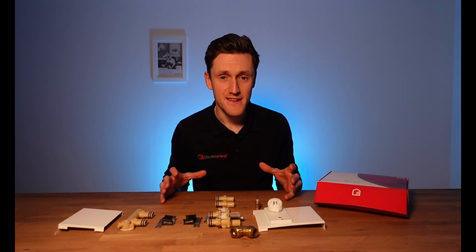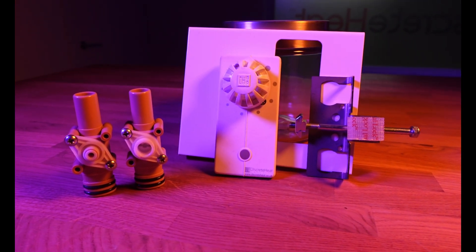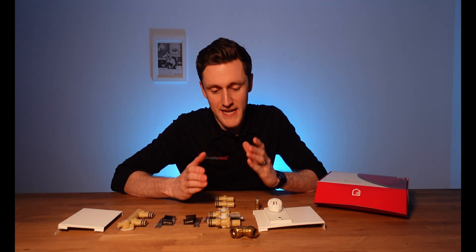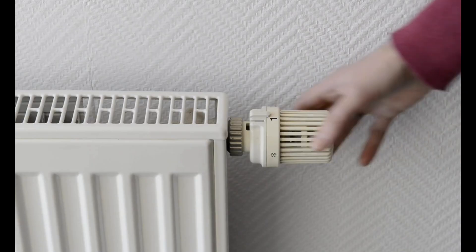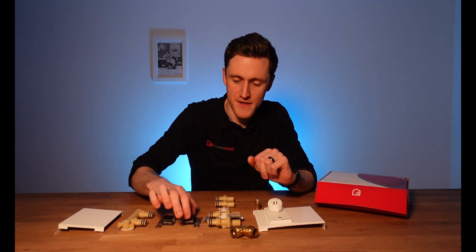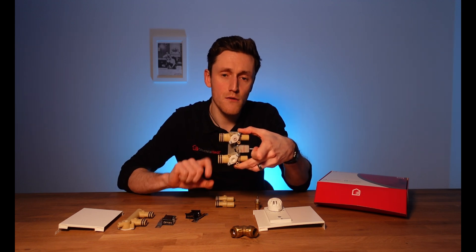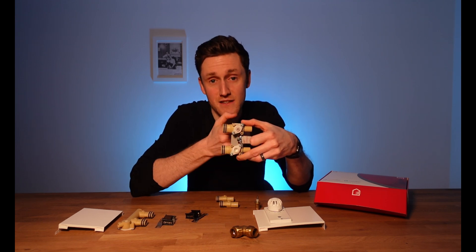The feed and return kit contains everything that you need to connect from your pipework onto the skirting profile itself, and we have two main options: a TRV version and a non-TRV version. TRV stands for thermostatic radiator valve — it's basically the thermoskirt equivalent to the standard knob on the side of your radiator. These are held into the end of the skirting by a stainless steel retaining clip and the TRV bracket, which is designed to hold the valves parallel to the skirting profile and stop any pipework pulling on the fittings and warping the valve body.